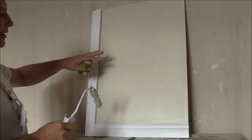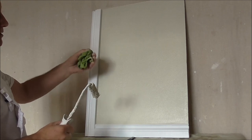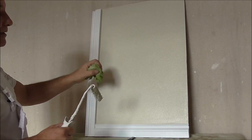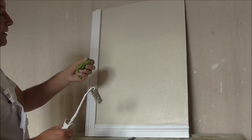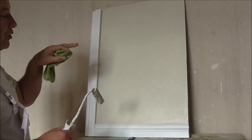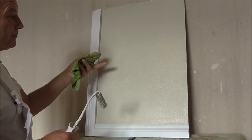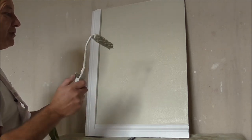And then if it's a washable paint, scrubbable paint, and you come to start to get a damp cloth on it and start wiping at it, then if it's contaminated with paste, the chances are the more you rub at it, the more it'll work through. It'll just work up. So always remove paste before you're doing any painting.